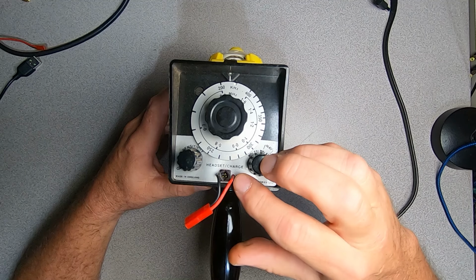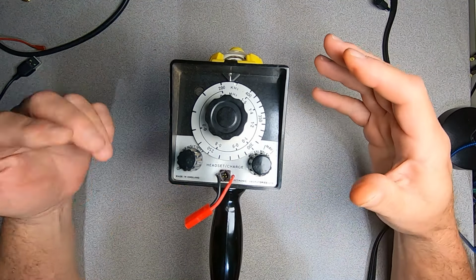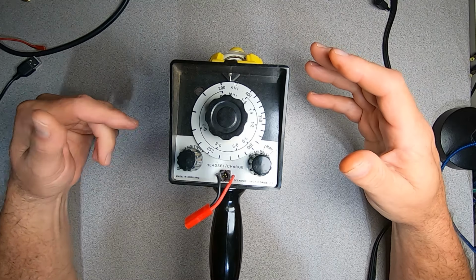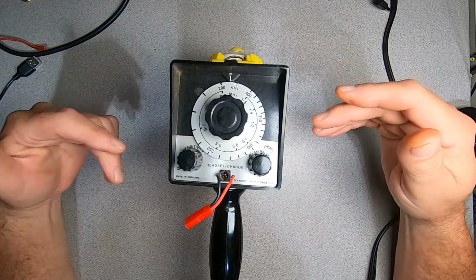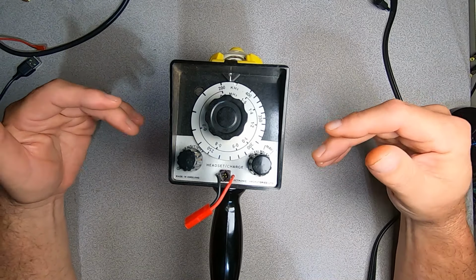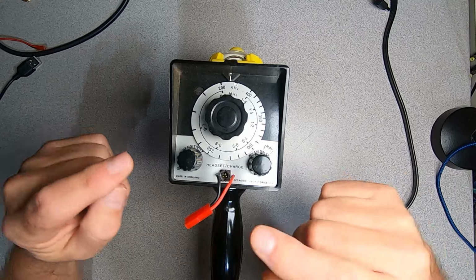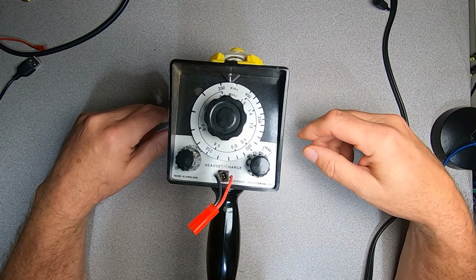In the center, there is a small 3-pin connector, and this is a charging port and an earphone port. The original earphones for this direction finder look like earpieces for a stethoscope rather than the earbuds that we are used to. I lack said headset, charger, or connector plug, so the JST connector tied into this connector allows me to listen to the audio with a set of earbuds.